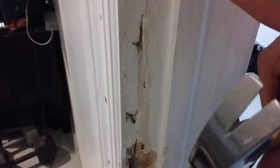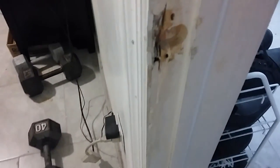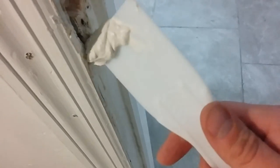Looking good, looking tight. The only thing we have to do now is fill it in with spackle right here, and we could do a little bit on this side too because the plasterboard cracked over here as well. Let's get started — put a good generous amount on there because we can always go back and sand it down once it dries.